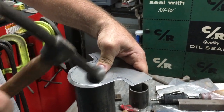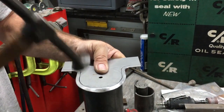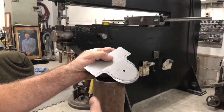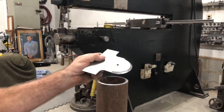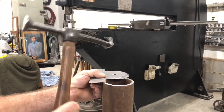Then we'll start working on the inside corners and kind of join them together a little bit. On the inside corners we have a whole lot of stretch to do right here, and then we're going to have to tip it over on that line. So what we're going to do first is start the stretch — I've got a barrel end hammer here that I'm using.